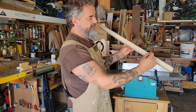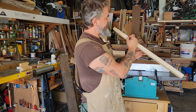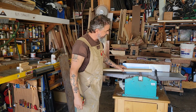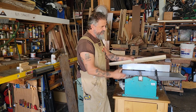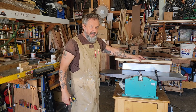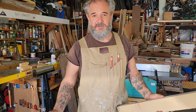As I've drawn here, what you want to do is sight your bow there, put a line on each end of it, maybe a couple if it helps you. Set it up in the beginning of the knife here, and just run through that center, keeping these ends up out of the knives until it looks pretty straight. Then you could start from here and flatten it that way.